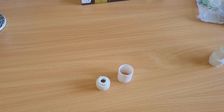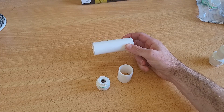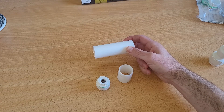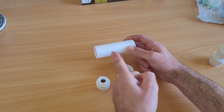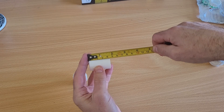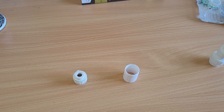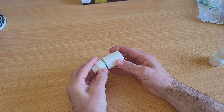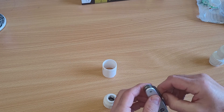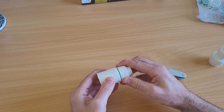Next I take some of the piping. When I initially did it I used longer lengths, but what I found was that the light from the laser pen was dispersed and didn't actually shine through the Star Adventurer. My brain clicked and I thought the reason is probably that I should be focusing closer to the lens — which is where your eye would be. What worked out as best is about 4.3 centimeters or 43 millimeters. I then tried to attach it but it doesn't want to fit, so that required the Swiss Army knife blade again, and I scraped out some of this part until it slots in quite nicely.